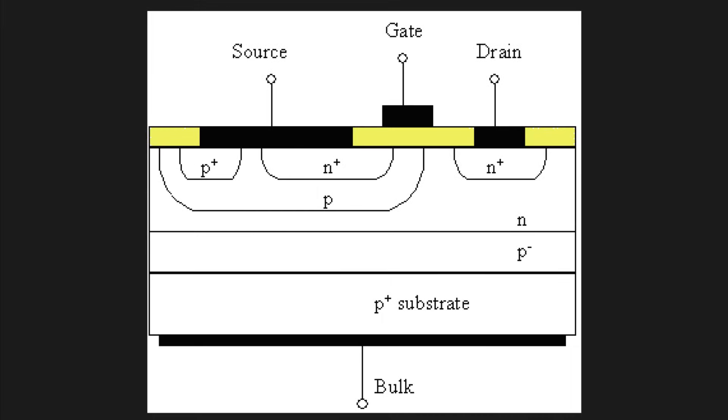In building an FET, they're generally on a piece of silicon, and you have depositions and doping on the device that makes P and N junctions and stuff. You have sources, drains, and gates. The gate keeps current from going side to side — it acts as the gatekeeper. All of the charge, all of the current, flows laterally — from side to side, only horizontally, nothing vertically.